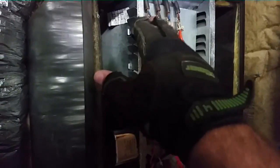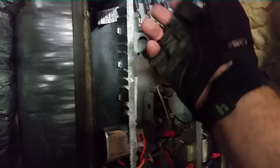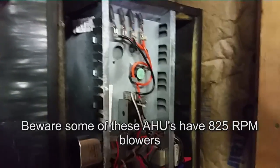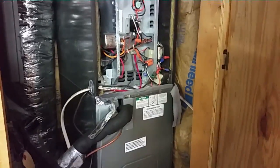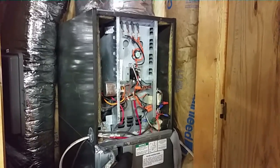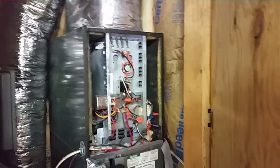Four banks there. This is what the Rheem used as supplementary heat — they had the rods extending down into the blower cabinet. See, there's four here. We're going to make sure they come on. It's kind of an interesting idea, and I'm guessing that's what they did to make it a shorter air handler, but it's a pain in the ass because if your heater goes bad, you can't just pull a heater out and put another one in.